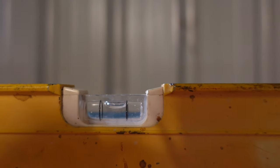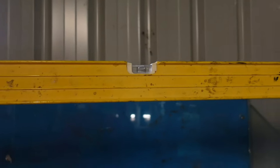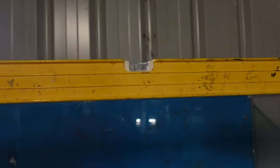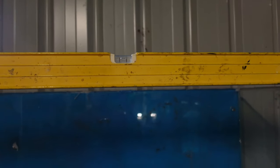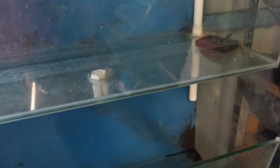Little trick with the spirit level when they're old — like this one, it's my old work one. If you're worried about it being level, put it on something, spin it around 180 degrees and try it the other way, and make sure the result comes out the same. Unfortunately this level is too long to sit on the inside glass, so I can't figure out exactly how level they are. I've just got to presume that whoever built this got them dead level from the top. I'll throw a tape measure down from the straight edge. Anyway, I'm going to level it off camera — you guys don't need to see that.